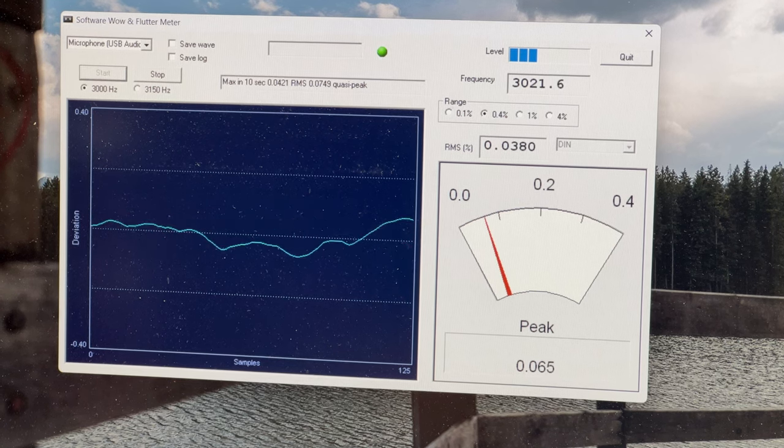for the switches, which are back in here. And remember what I said, there's a sliding plate back under here, which blocks the power switch, and we're going to have to take all this stuff out now. So keep in mind that this control and this control kind of look alike, but they don't interchange. So this is all just held in. So I'm going to just remove that, set it aside. And then same deal with the level controls. By the way, all these have already been cleaned. At least I think these come off now.